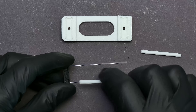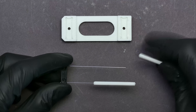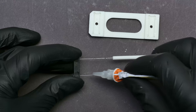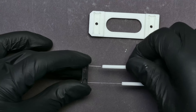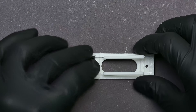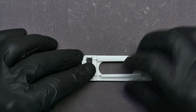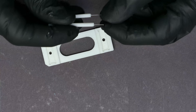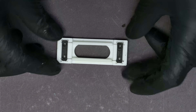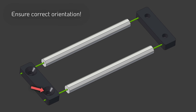Following a similar procedure, the stiffening rods are now glued onto the wires. The fixture is used to move the rods into the correct position before the glue cures. The second attachment block is then glued into place following the same procedure as for the first, with the fixture again providing correct spacing. To ensure correct assembly later, orient the countersunk holes of the attachment blocks opposite to each other — this detail is easily overlooked but crucial for proper fit.